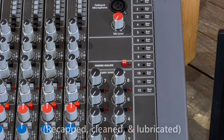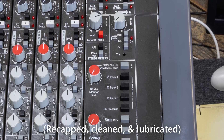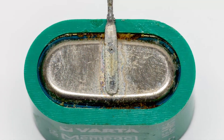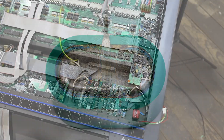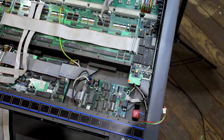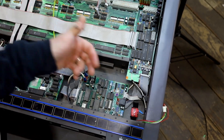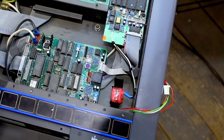The next thing to address was the battery, which I snipped off with some wire cutters when I was down at Ben's studio in St. Augustine, Florida. It was a good move at that time because it had started to corrode and it looked like it was leaking — if it had gotten any worse it would have corroded the circuit board. Thankfully I caught it at the right moment. Now I decided to put a new battery in, but mounted on a tether, wrapped in heat shrink tubing and held down by Velcro.